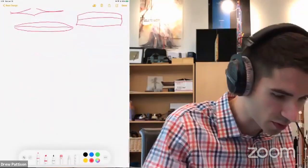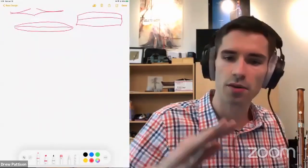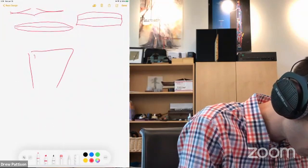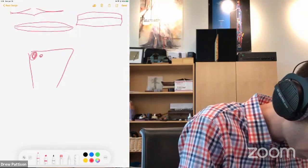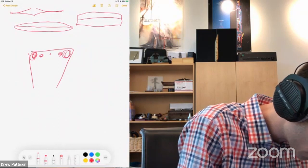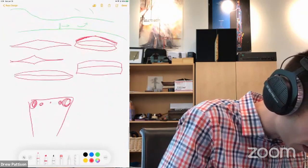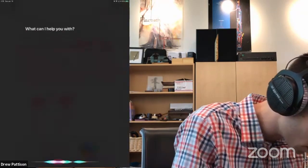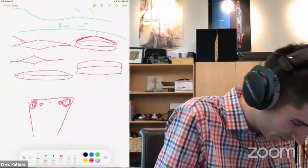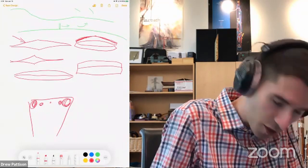So again, that's what Jordan was talking about. That's what I was trying to do as I was scraping. I worked the most here and a little bit here and almost none here, and that would give us, in theory, this diamond. You know what I mean?